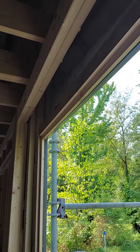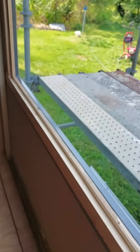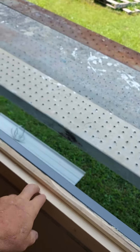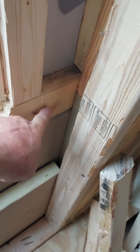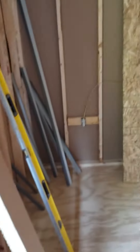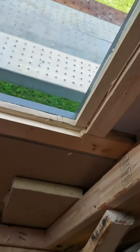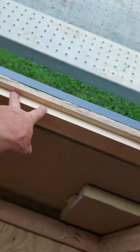The top's not nailed in yet — that way when the window goes up it'll give me a little bit of leeway up there. The bottom is a purlin, which is part of the building. It goes all the way around, wraps the whole building. You can't see over there because I've got insulation in, but you can see them up there. They go all the way around, and that one's part of it, so I had to cut this one out where it was.